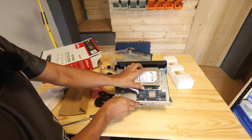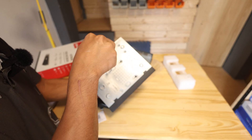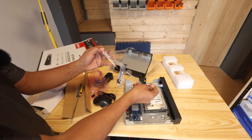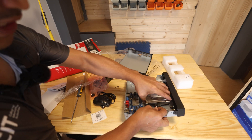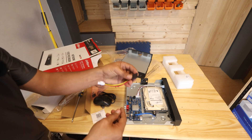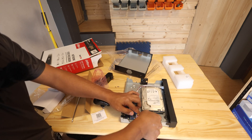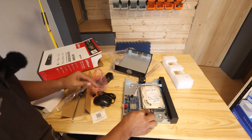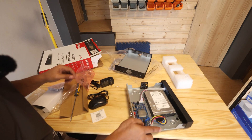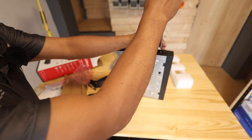I'm going to mount the hard drive here — this is where it's supposed to go. All NVRs don't have the hard drive pre-installed, so you need to place it yourself. This is the SATA cable that comes with it — we plug it on the SATA port, easy plug like that, then we plug it here. Then of course the power cable goes here as well. Take note that this unit doesn't have a POE switch. Some other devices have the POE switch at the back, but this doesn't — we have a separate POE switch, so no problem.